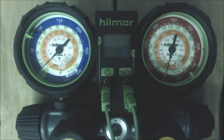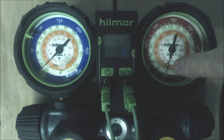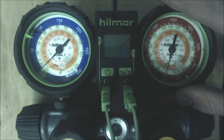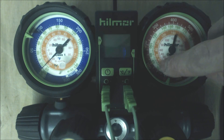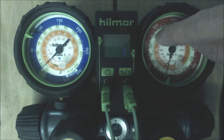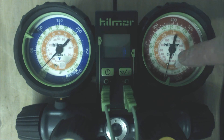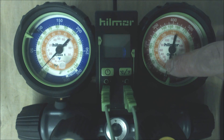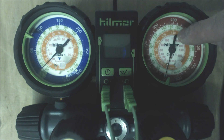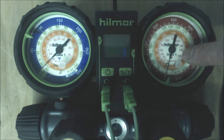We compare that temperature along with the pressure using the green saturated temperature ring on the inner ring of the gauge. You have your pressure ring on the outside, then the green saturated temperature ring — that's the saturated temperature in the middle of the outdoor coil. If it was orange, that's 404A, used on refrigeration systems. Then you have R410A, which is a light pink or rose color. So that's the saturated temperature on the middle of the condenser coil.